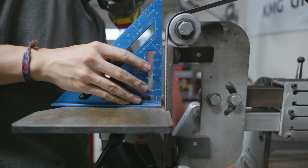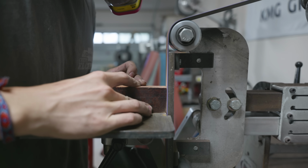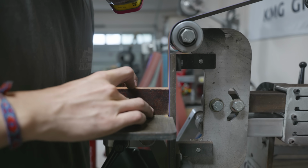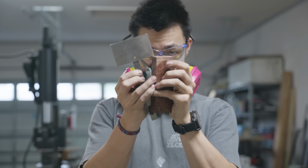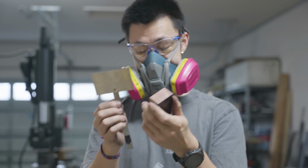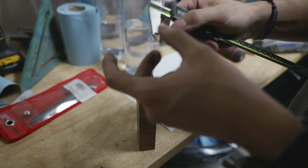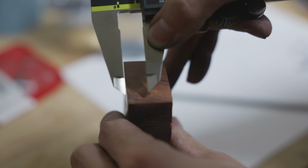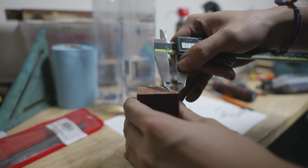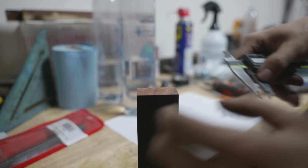There's something that I do want to clear up regarding handle making. I see a lot of comments asking, how come you're not doing a full tang construction on these high-end expensive knives? So full tang construction is definitely functionally stronger than a hidden tang construction, but the knives that I make don't necessarily have that strength as their most important attribute. Everything that these will be used for, the hidden tang construction is more than strong enough for. I wouldn't be able to do the hidden tang guard fit-ups that I did on my bowies if I did a full tang construction, and I wouldn't be able to do the spacers like I did on the chef's knife if I did a full tang.